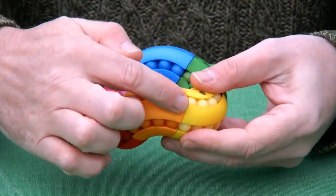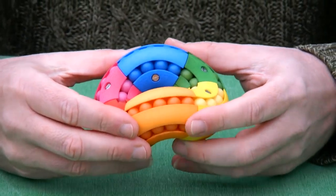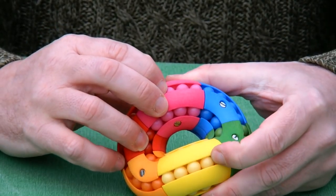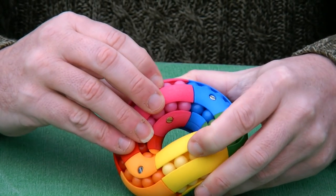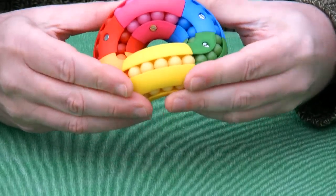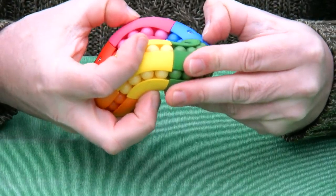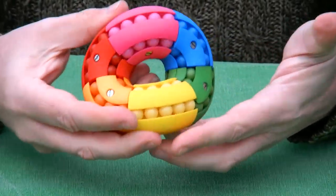All the channels are at 72 degrees, which is 360 degrees divided by five. All the beads can slide, though this one was printed slightly fat so the sliding doesn't go that smoothly. That's too bad — the 3D print was well within its specification, but unfortunately such things happen.